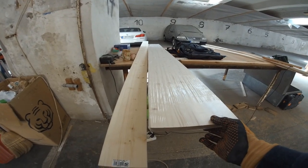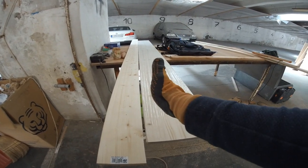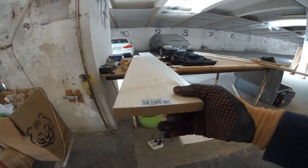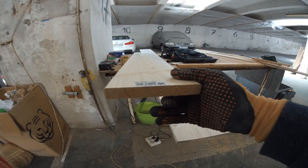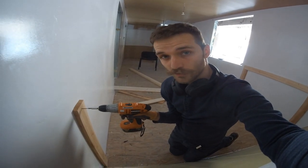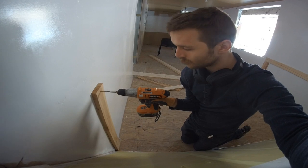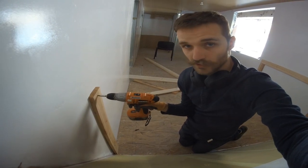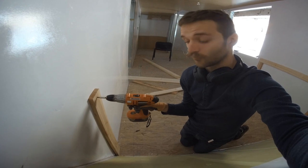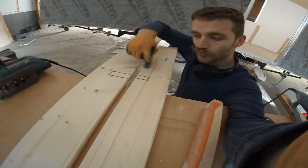This vertical one will be 20cm wide because it has to be the facade of the bed, and this one is purely for strength in the back — I won't see it and it is 214mm wide. I'm screwing the vertical beams to the wall just for stability, not to hold any weight, and I'm not tightening them very tight. That way we have some slack for the weight to go into the floor. At the joints I'll make them fit nicely together and slot together like this.